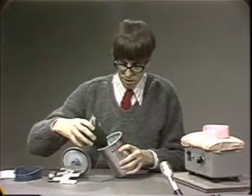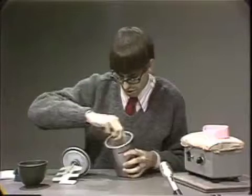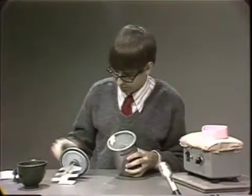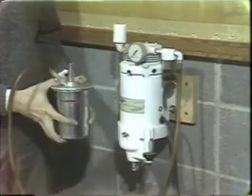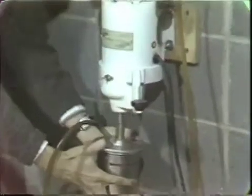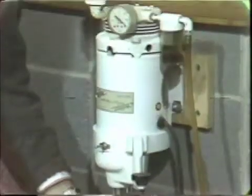And as you can imagine, this is rather difficult to mix by hand in such a small bowl. We will add the powder to the water, and then using the hand spatula, we will wet the powder particles prior to mixing with the vacuum spatula. We are now ready to vacuum mix this plaster and first we will add the vacuum hose to the insert on top of the mechanical mixer. We will now turn the machine on, engage the clutch and mix for 30 seconds. If you will notice, the vacuum gauge is reading almost 30, which indicates a good vacuum.